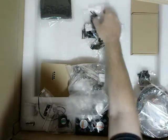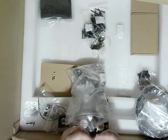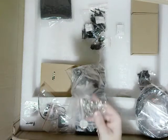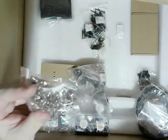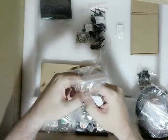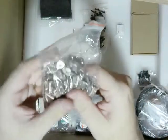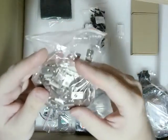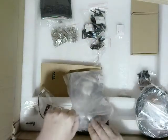So they are highest quality. M3 hammer head T-nuts. So these are the little ones that go in, stick them in sideways, stick the screw in them, rotate them, they'll go all the way home. Wonderful little devices. And here we have the other style with a little springy ball. So these can be rolled into the extrusion and then they'll generally snap approximately into place so you don't have to fiddle them around. Whereas this style, if you tilt the chassis, they'll run away and you have to go and find them.